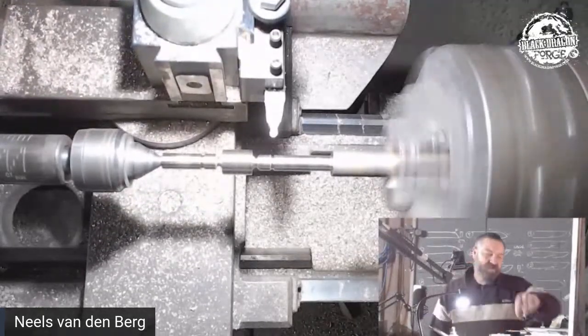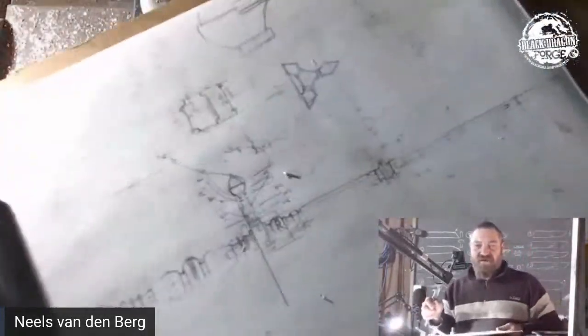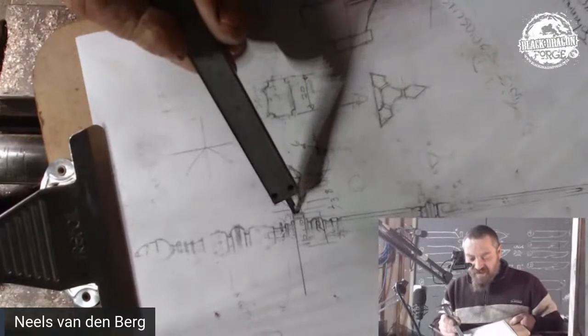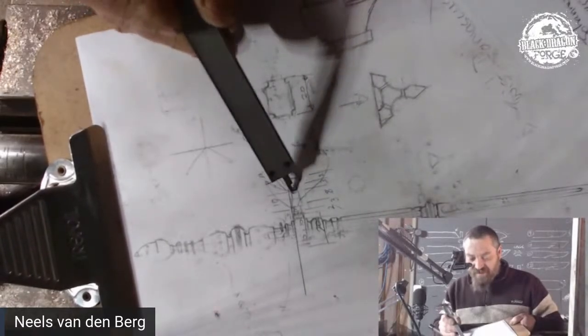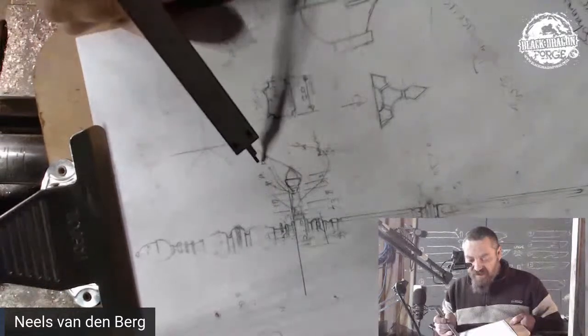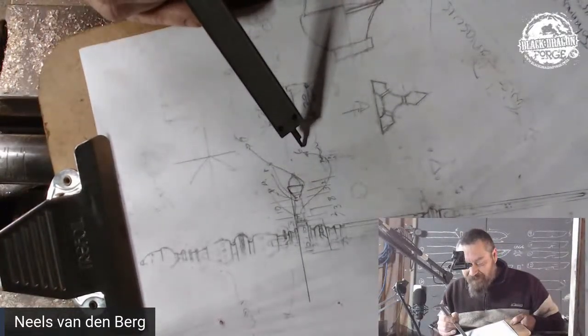Nice. So now that we've got that, what we have so far is we've cut that shoulder, and we've got those two cuts. So now I need to decide the thickness or the diameter there, which I've already done, and said I would really like that to sit at a 6mm. Okay, so